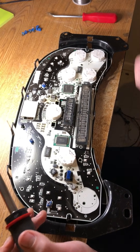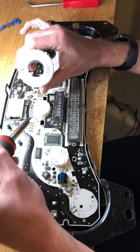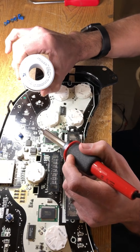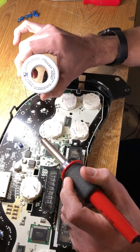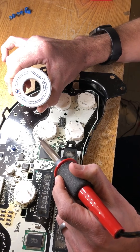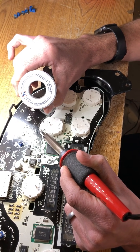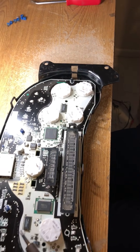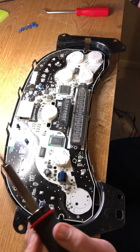Now to reinstall LEDs, we're going to go around to each of the tabs. Where each bulb was, there are four circles, but you can tell two of the four have a little bit more solder on them — that's where the bulbs were attached previously. So you're going to add just a little bit of solder to each of those joints. Go ahead and do them all at the same time, but only add it to the ones that already have a little solder from where the bulbs were.